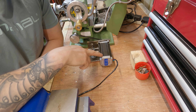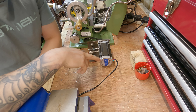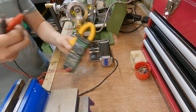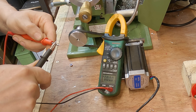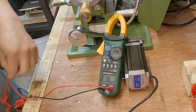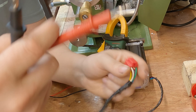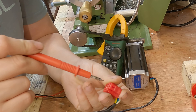The first thing you need to know is which two wires go to which coil. To do that we're going to do a continuity test, so you'll need to grab yourself a multimeter. You want to check the wires and see which ones have a slight bit of resistance — you're not looking for open circuit, you're looking for a couple of ohms of resistance.